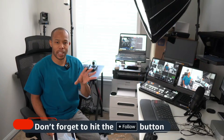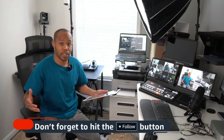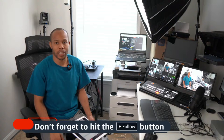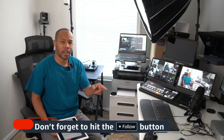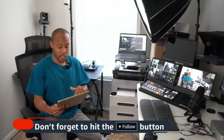So when I first had the setup with the SDI connections, I was trying to figure out, is it the SDI cable that's not working that I already strung up and wrapped up all nice and neat? Because the last thing I want to do is replace the cable that I spent so much time setting up. And then it was like, okay, well, is it the converter boxes? Is it that converter box? Or is it that converter box? Is it the HDMI coming from the converter box? Or the HDMI going to the camera from the converter box? So there's just so many different things you've got to troubleshoot the more elements that you bring into your live stream setup. So the HDMI one-way connection that allows me to go to 100 feet is just way easier to use.